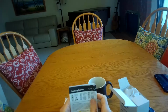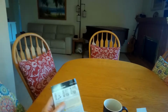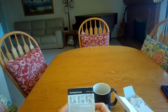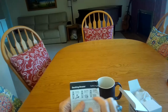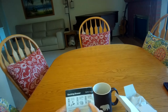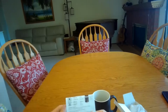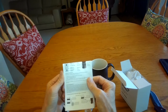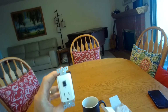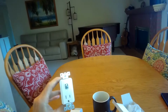Also, it has some other types of sensors that can plug into and interlock with this thing. Not only does it have one for heat and smoke, but it also says it has a general purpose limit switch you can plug in, also a blade limit switch, and a remote thermostat switch. So it's pretty slick. But today we'll be doing one for an appliance, and we're going to put this over top my microwave oven in the kitchen. So it'd be really good to have that safety.